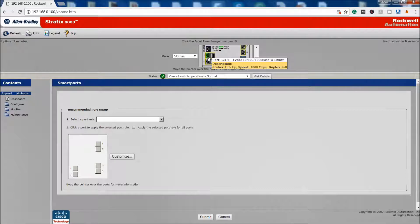To describe the Giga ports on Stratix switches: they generally have two Giga ports, sometimes four, and some can have more — it really depends on the part number you have. In this one I have two Giga ports, and I'm able to set those up either via copper, which is RJ45, or through fiber. In my case I have copper, so it's an RJ45 connection.